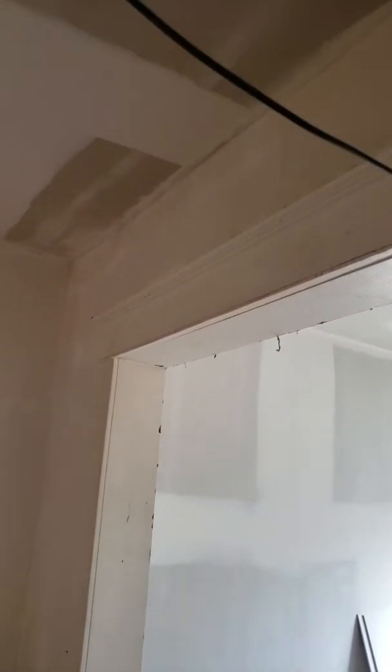I think it's going to bleed through the mud again — I'm not sure. I'm hoping the sheetrock will fix it, but by the time I put the next coat of mud on, it's regular finishing compound and it holds the moisture longer. That's why you get bubbles — if you have wallpaper behind it, the regular compound holds the moisture a lot longer than sheetrock does. Hopefully that'll fix it; we'll find out tomorrow morning. I call this a process because there are two coats in the finish coat when you're straightening and skimming full walls like this.